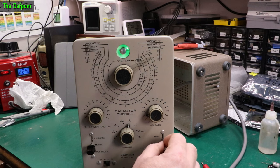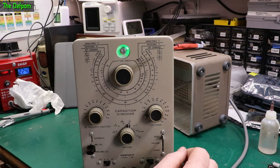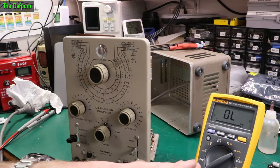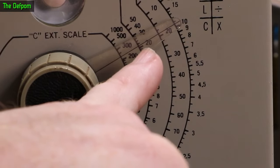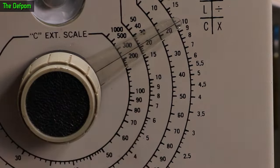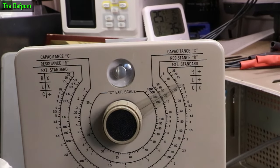This switch has been sitting in a dirty spot and it's got slightly better now, but before it was always shut — I couldn't find the capacitance value at all. That capacitor is a 0.22 microfarad, and it's basically bang on — just above 20 on the times 0.01 range. So it's actually really accurate. When it is working, it's accurate, which is good.